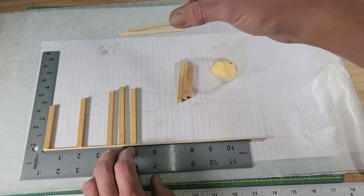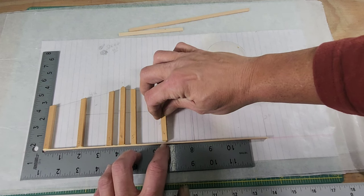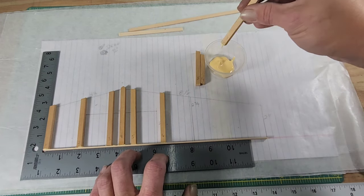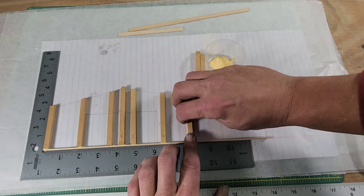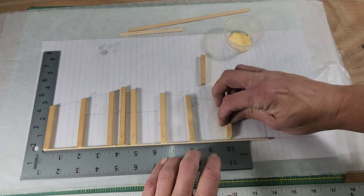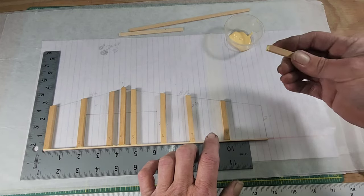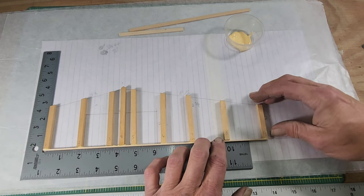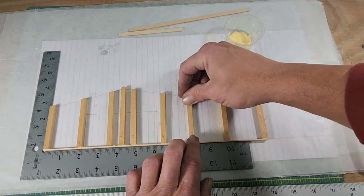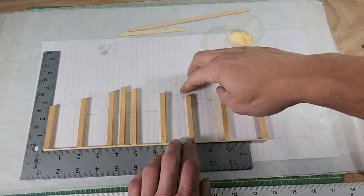This goes over here, and then we're going to put another piece on here which will straighten out the tops. We're not real worried about the tops not being exactly square just yet because we're going to put a top rail on here which is going to fix all of that. Now these last two — this barn is going to have a lean-to on it, so these last two are spaced further apart than the other ones because they are going to be outside. This number seven here is going to be the end wall of the building itself, and then the rest is all going to be lean-to.